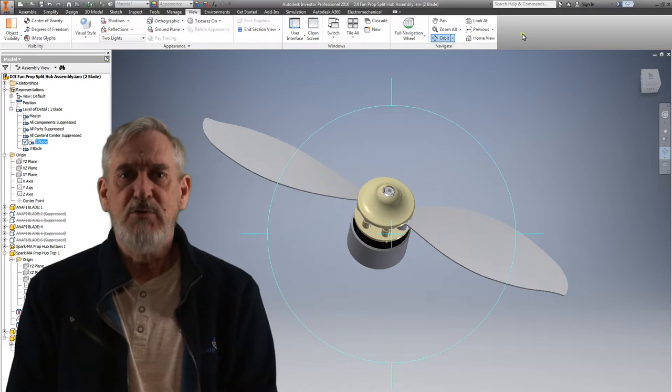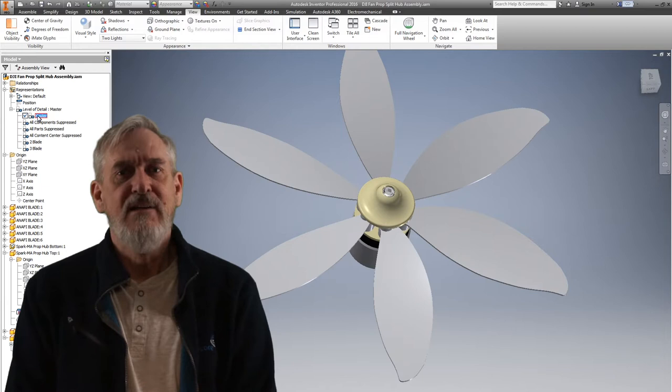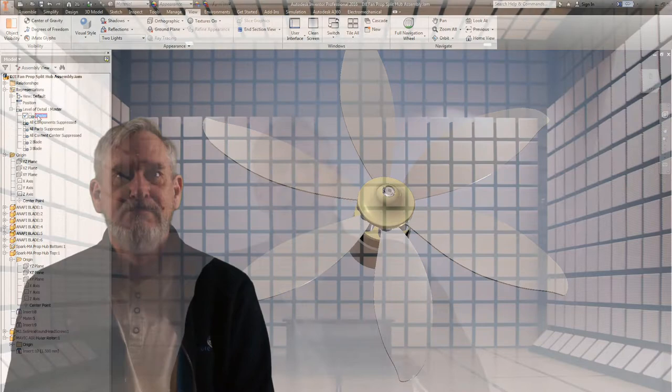The design of my hubs went one better though. If two Anafi blades were quieter, what about three or maybe six blades? Theoretically, for a given amount of lift, more blades should reduce the motor RPM to generate the lift, thereby reducing the noise even more. I tested the prop designs inside my house to eliminate wind effects and background noise. An anechoic chamber would give absolute noise and frequency data, but in-the-house testing was good enough for a comparison of the configurations.